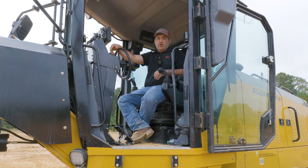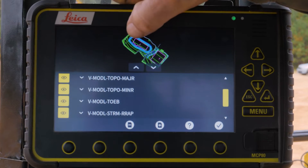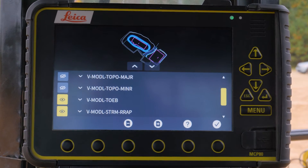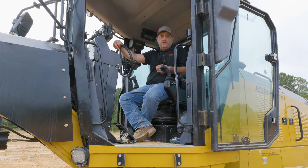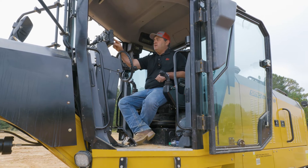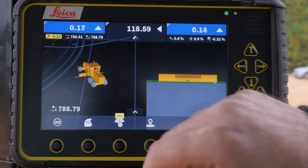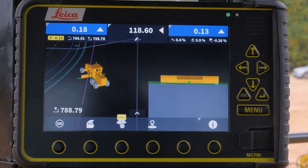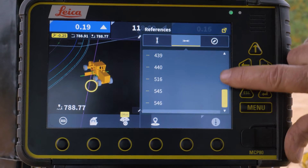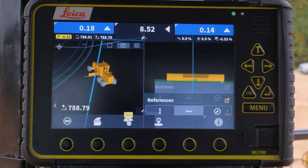In the past it was hard for a lot of people to get the line work on the screen they wanted to see. For instance, I can see all my major and minor contours — the green lines — but I don't want to see those, so I'm simply going to turn them off. Maybe if I'm doing a building pad, I might not want to see the parking lot stripes and all that. So now we have a much clearer screen. This guidance here is telling me how far the reference point of my blade is from a line — right now I'm 118 feet from a line. I don't know where that line is, so I'm going to touch the screen and pick a new one. The one you want is always right at the top 99.9% of the time. I chose that line now.